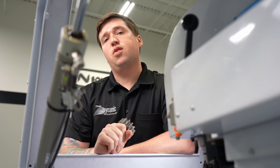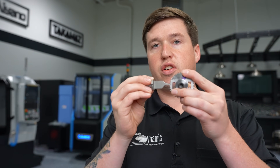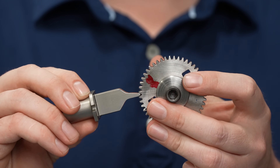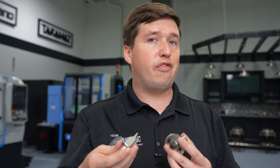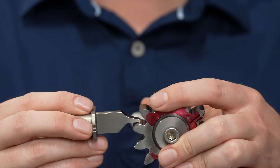The next thing you need to consider is your stylus. Your stylus needs to fit into the entire profile of your gear. As you can see here, it can't make it to the bottom of this gear. So you can't really expect the machine to deburr the full profile of the part if it can't follow the full profile of the part. You need to make sure your stylus can fit the entire profile of your gear.